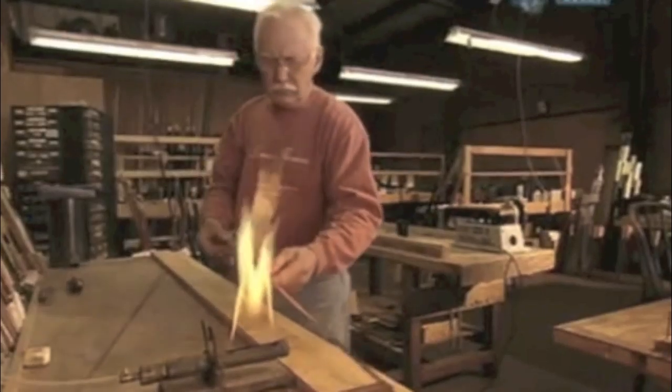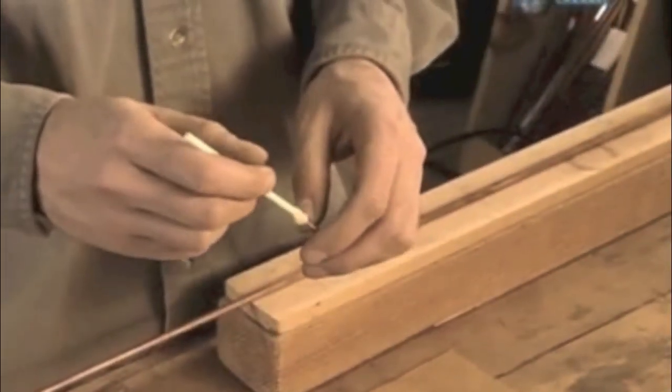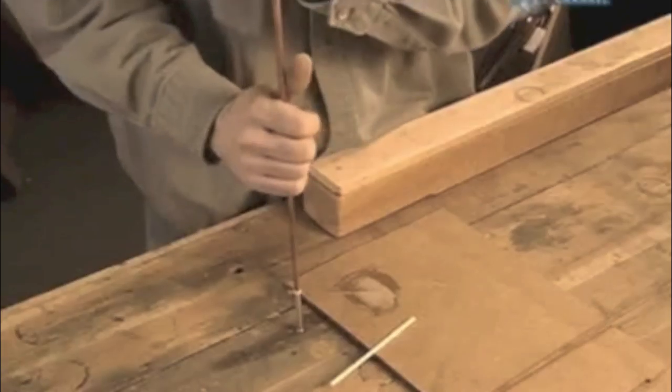The pieces are now laminated into one, but the result is never perfectly straight, so the rod maker heats it over an open flame. The heat softens the bamboo, so the kinks can be smoothed out. Next, ferrules made from nickel silver are glued onto the laminated bamboo pieces. This tubing will be used to connect the tip and butt.